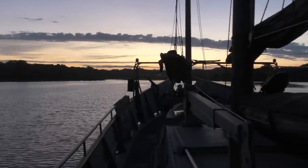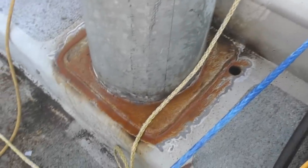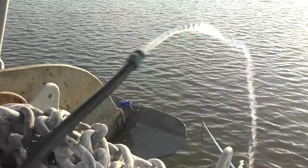A new day and a new crop of mayflies. It was a beautiful morning. We're working on that mast up there this morning. We got a lot of rain — it took only a day for that to rust up. First step is to pump all that water out down there. This is the bottom end of the forward mast. I got some lead ballast stuck in there — a little bit packed around here, but there's a lot more that's got to come in. So I'm cleaning this up and looking for any damaged paint, and I'll fix that. Get that done and load up with ballast. Up here is the partners — where the mast comes through from above — and it's all welded in from the top now. I gotta clean up all this burnt paint and redo it.